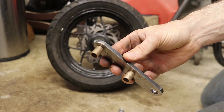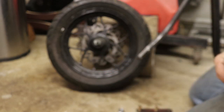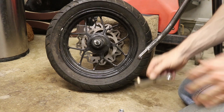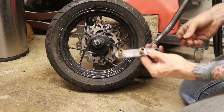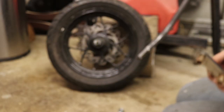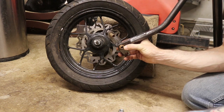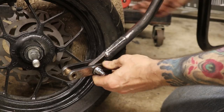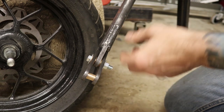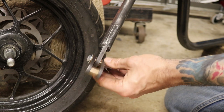I've got some bronze bushings here — this is the suspension linkage for the front. I also have a number of bronze washers. These are thrust washers, which technically are washers designed to have friction in them. I'm going to put them on here — a series of these spaced out in between sections that are going to be moving. This guy goes on, another bronze washer on the other side, and we've got another bit of linkage. That is how the linkage will work. These are oilite bronze, which means they're impregnated with oil, so they will constantly be giving off oil as they rotate — designed exactly for this sort of purpose.